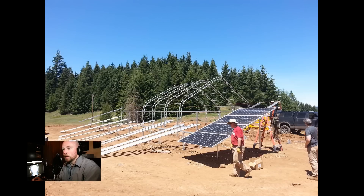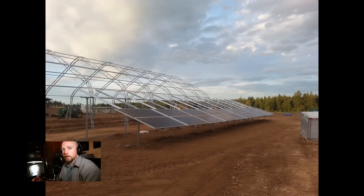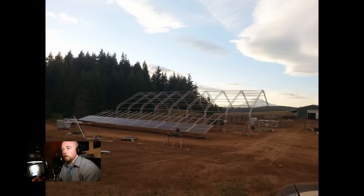This was during our big work party. You have to make sure everything lines up correctly, so we actually had to do it a few times. We figured out the right way is to get that very first layer on at the very bottom, because everything kind of sits in from the top. There are little rails that the panels and bolts attach to, so you get that first row on, make sure it's plumb and straight, and then everything else just slides right in place. On the lower left, there's a four-foot by four-foot by four-foot cement block — that's for wind power in the future.